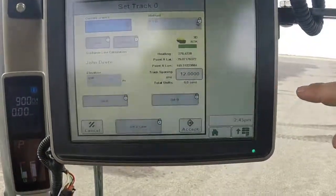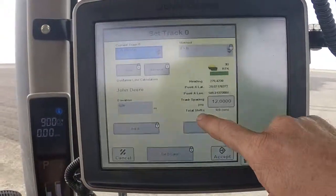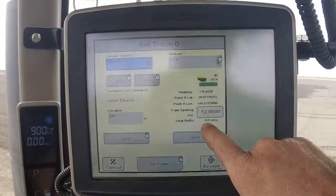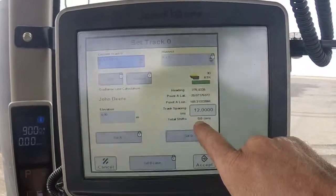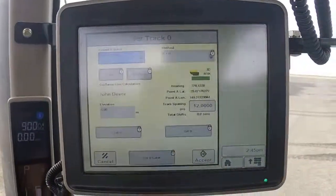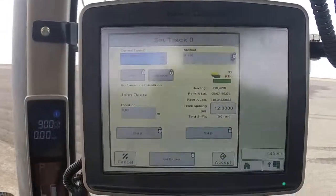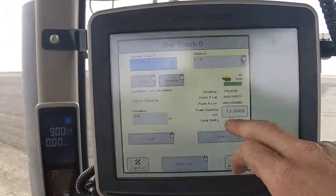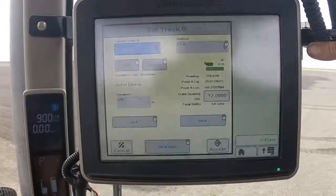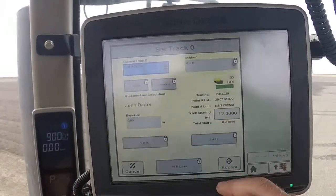You just need to make sure that the total shifts are zero. For irrigation work, there are never to be any shifts in against the grain AB line. Sometimes shifts will be used — they'll be preset in dryland or broadacre fields — but for irrigation, always zero. If you check that and find there is a shift in there, contact your manager and we will sort that out. This one's got zero, so it's all okay to go.